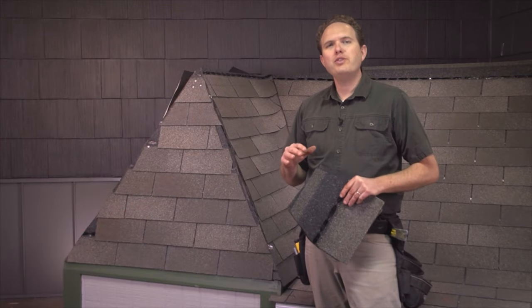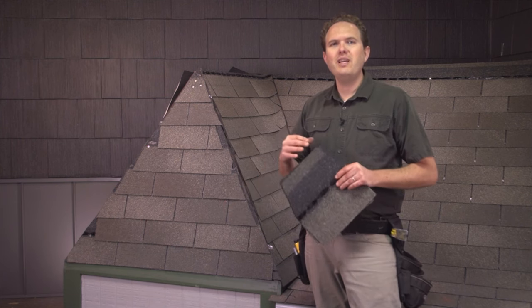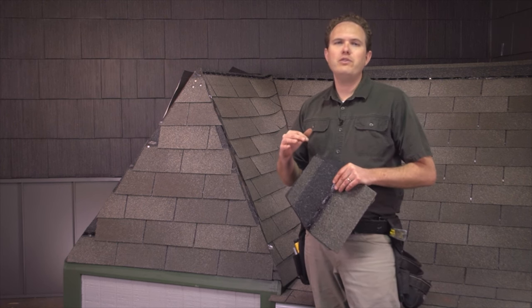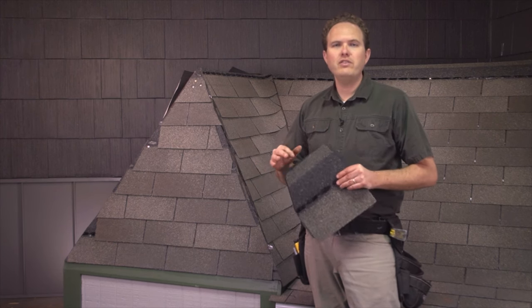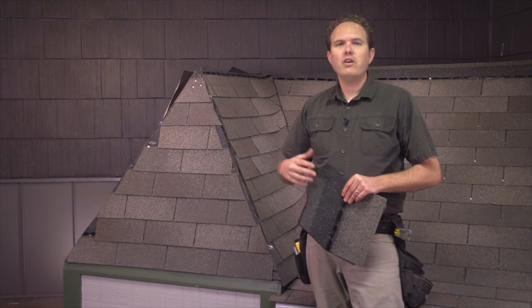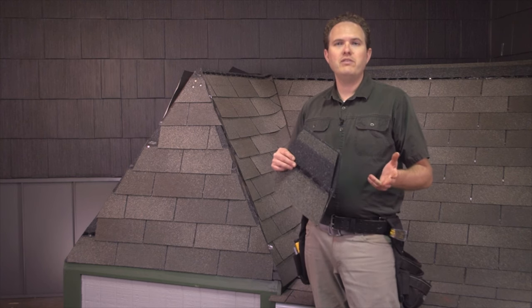In this section I'm going to show you how to apply cap shingles to both the hip and ridge sections. To finish off these sections you're going to use the same cap shingle. You have a few options as to which type to use, and no matter which variety you use, they're applied with the same technique. Your most basic option for hip and ridge shingles is to use a three-tab shingle. If you're using a three-tab on the rest of the roof like we are here, this is going to be your easiest option because you'll have some on hand.